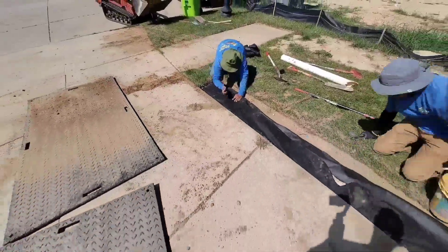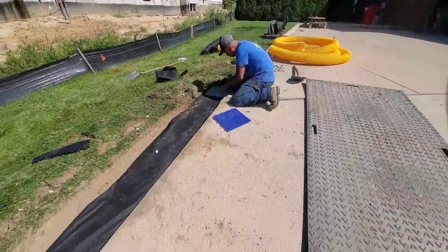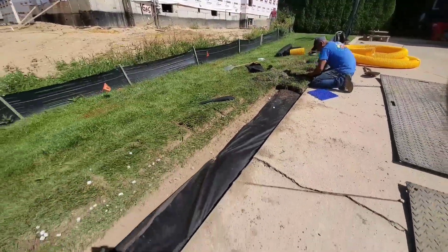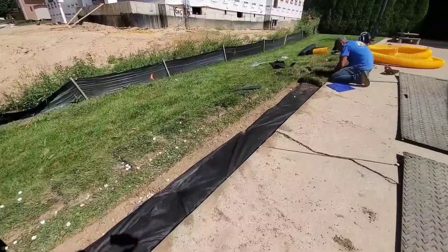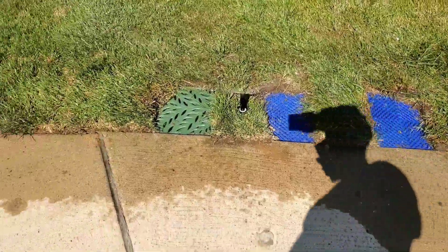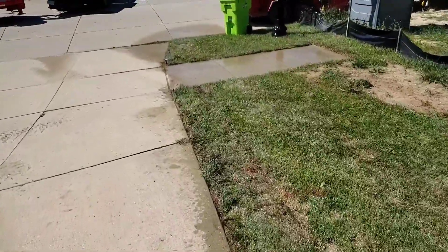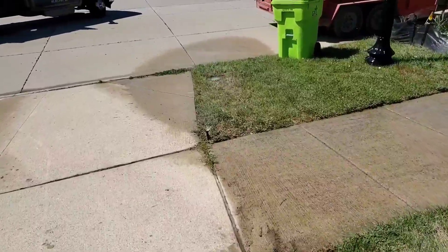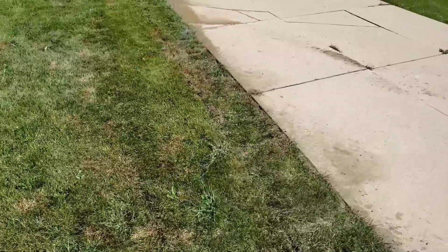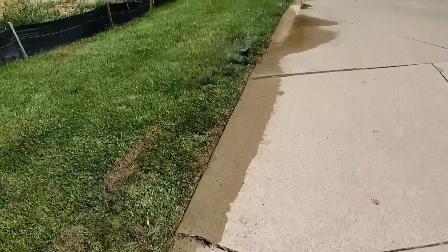The guys have the fabric cut so there's no big overlap. You don't want a big overlap because there are holes punched in the fabric - if you have a big overlap those holes are not going to align. Trim any excess and just have a couple inches of overlap, then use fabric pins to pin it in. Here's all the sod in place, the blind inlets in place right next to that catch basin - we're going to grab up all the surface water that's been sitting on this driveway. As the grass grows through the fabric it just gets better and better. There's our pop-up with the turf restrictor plate - we try to stay two feet off the curb so it's not in harm's way when snow plows come through.